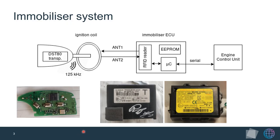So what exactly is an immobilizer? It is the main anti-theft measure in any modern car. Before they were in place, a criminal could hotwire your car by touching the ignition wire and the main voltage line to start the car. Now with immobilizers in place, when the key fob is inserted in the ignition barrel and turned, the immobilizer cryptographically authenticates the key fob, and only when it has been previously paired to the vehicle, it sends a signal to other ECUs in the car, which can then start the car.